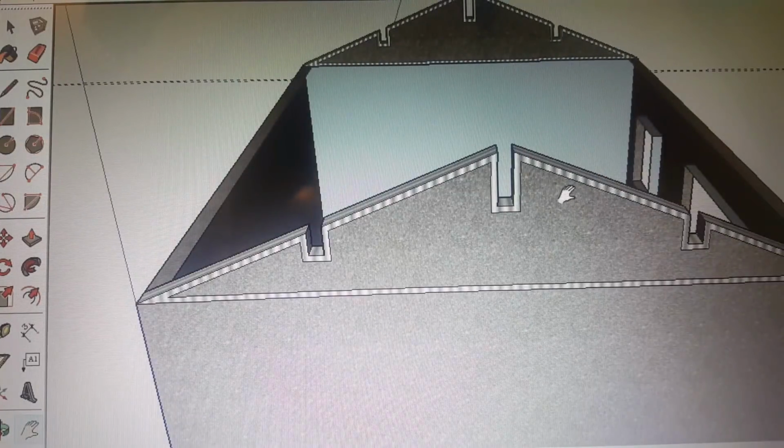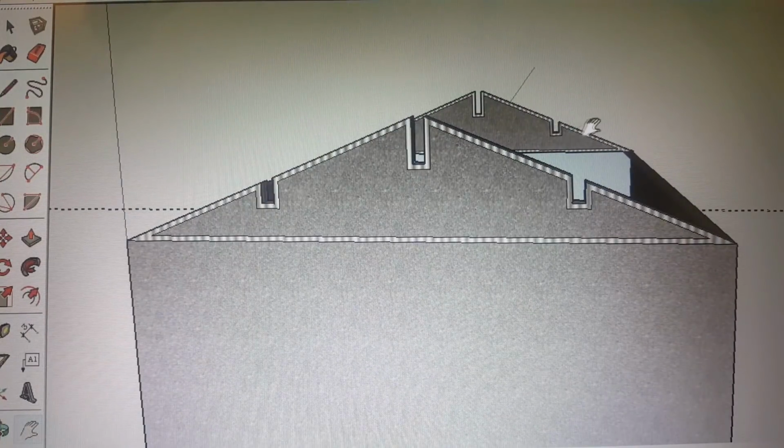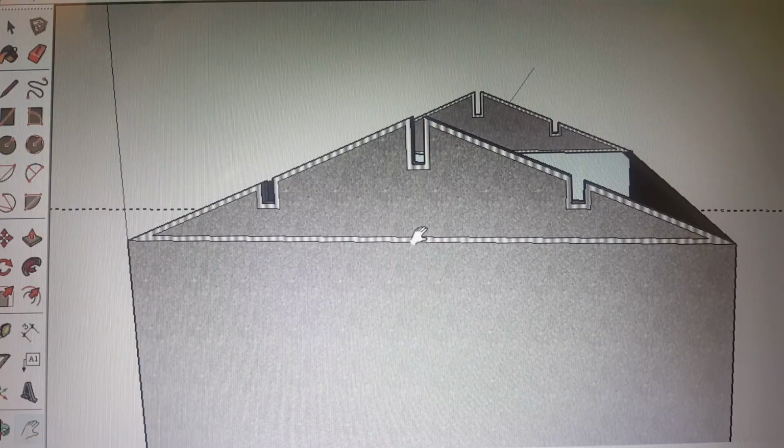But on the gable end, a little smaller, there we go. On the gable end, you see the metal stud around the outside and the pockets. I actually put a stud from the bottom of the pocket down to the bottom part of the form right in this area. And a lot of people were concerned about that. Some people thought I was putting it there as a post for some kind of support mechanism, and that's just not the case at all.